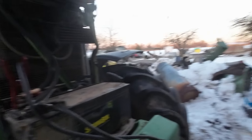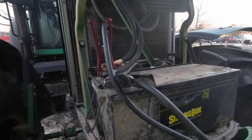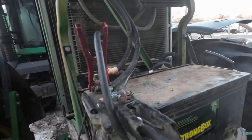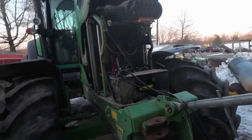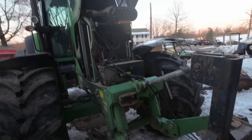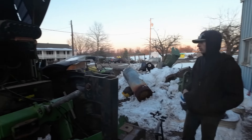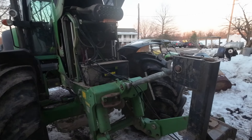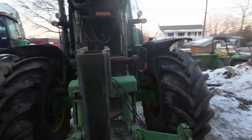The camera decided it was too cold because I magnetically attached it and it is below freezing. The DJI Osmo 2 doesn't like cold or hot. So I put the battery in, greased it, tightened it up, and put the charger on it. I'm going to let the charger run. That's the battery out of the tractor that Dad just left with. I think the alternator on that other tractor is getting weak because it didn't start up as nice as it should have. When we first put that battery in it fired right off, and now it's back to 'maybe.' I'm thinking the alternator's gone bad, so I'll have to change that out.